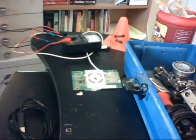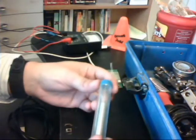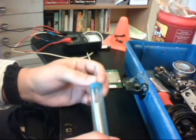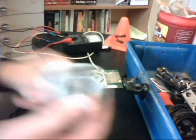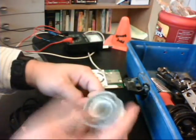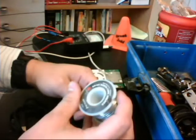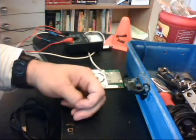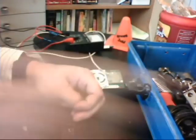You're also going to need some solder, preferably rosin core so that you don't have to use flux. With rosin core solder, it comes with the flux inside of it. This is standard PC solder that you get out of any PC repair kit. I got a whole roll of 60-40 rosin core solder. We'll probably end up using that, depending on the size.